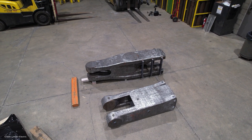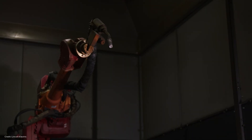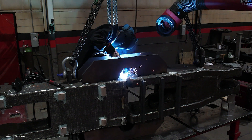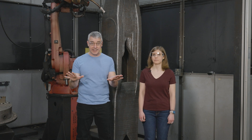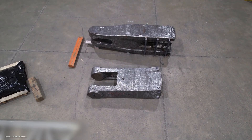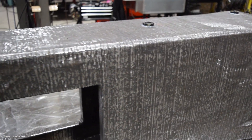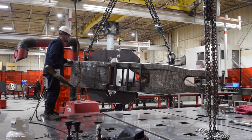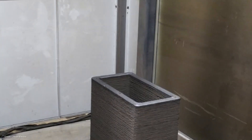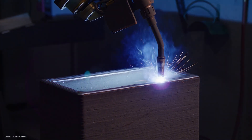The actual part had to be produced in two pieces — 3D printed in two pieces because of the limitations on the reach of the robot. The two pieces were then welded together, which is fine since the whole part is welding. That separation into two pieces actually helped with lead time. One piece was 4,000 pounds and was 3D printed in about four weeks. The other piece was 2,000 pounds and 3D printed in about two weeks. But because that work was done in parallel, the combined 6,000-pound component only required a four-week window to print entirely.